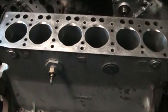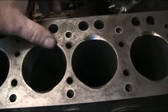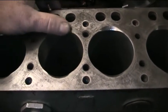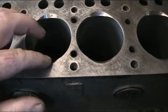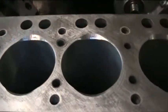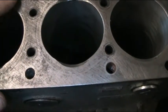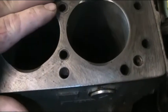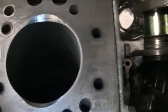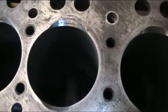Now we fit the liners to the Bristol engine. We knew this was going to be a complicated job because of the recesses for the exhaust and inlet valves where they're scalloped into the block, just here and here. The liners have been feathered in. There's no need to deck this block — we don't really endorse that unless we have to. You cannot really see where the liners meet the block.